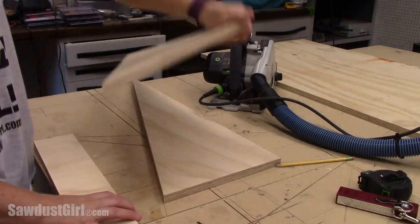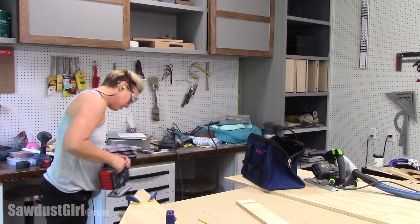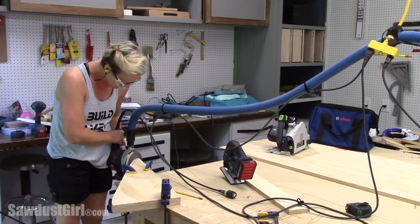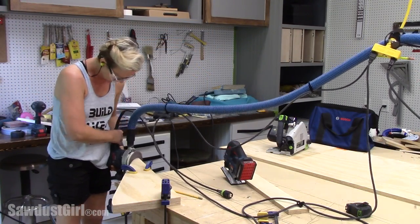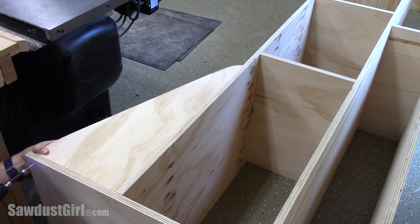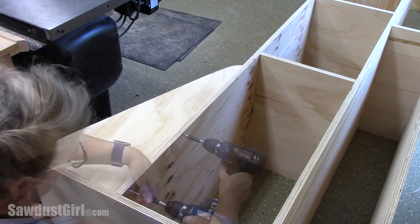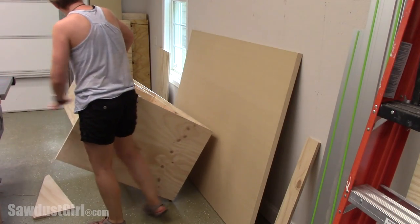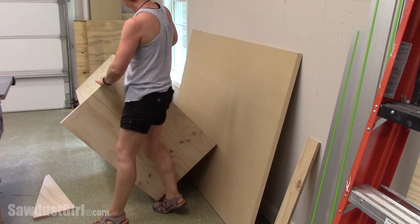To create sides on my little platform I cut a piece of wood in half at an angle so I ended up with two triangle pieces, and I sanded the exposed corners so that they wouldn't be sharp. I drew screws through the bottom and back to secure the triangle pieces onto the cart.